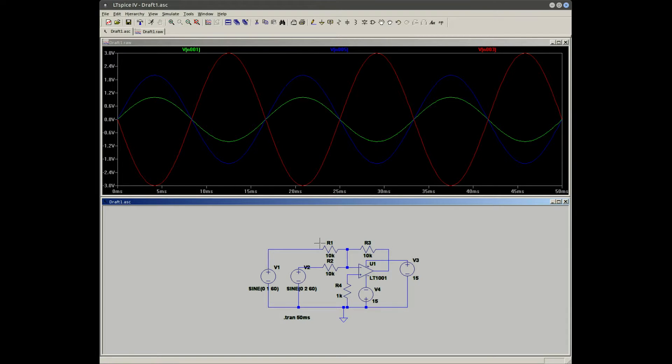People will ask: why is it summing the voltages V1 and V2 together? Why isn't it seeing R1 and R2 in parallel and acting like a normal amplifier with a gain of two? Well, that's because in the summing amplifier circuit, the inverting input being at zero — virtual ground — is isolating the inputs R1 and R2. So the op-amp sees R1 separate from R2; they won't act like they're in parallel.